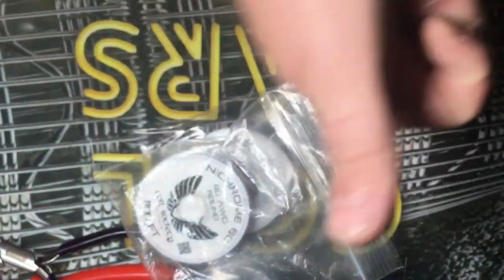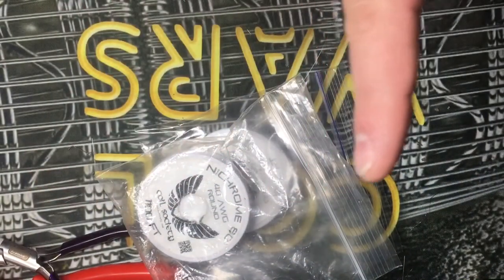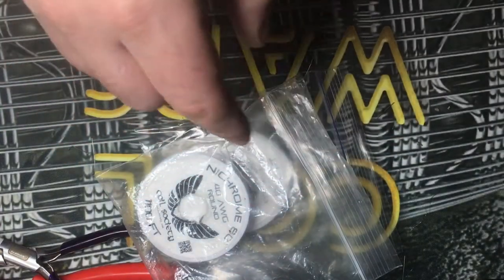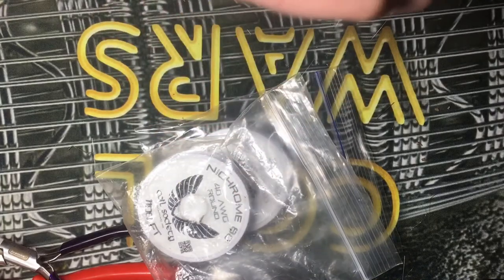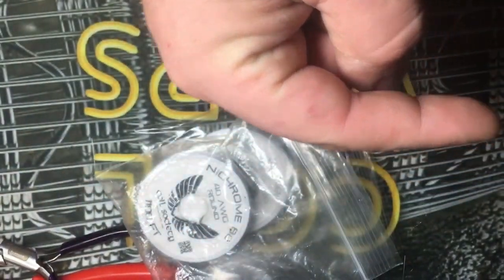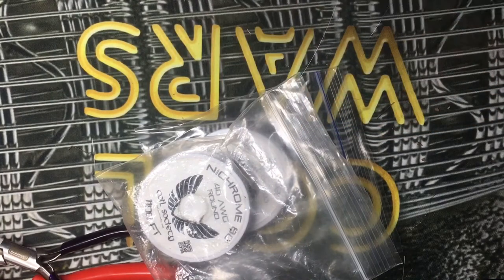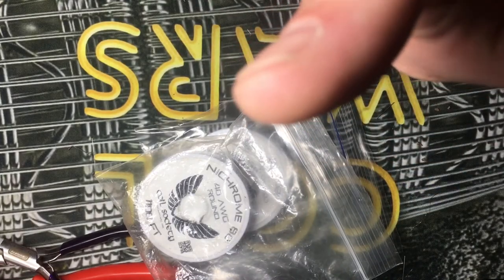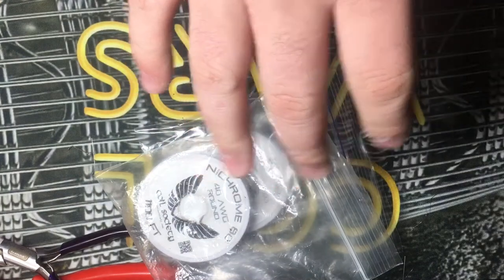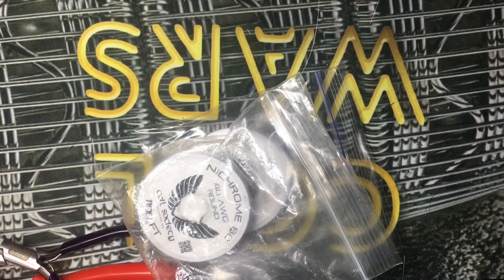My drill is on this side, and my swivels are on this side. So ultimately the fuse is going to be coming across this way and stop. I'll put the baggies with the corners where it's feeding the wires out facing the drill, but I place them on this end of it. This way when you're fusing down towards the end, you're not trying to drag the baggies along. They're feeding from the far end away from your drill, and the corner that the wire is feeding out of is facing the drill. This will help the baggies stay on the floor and the spool spins inside of them and they cooperate better. So some of you guys that are fighting with the baggie method, this can probably help.